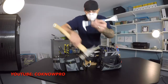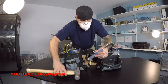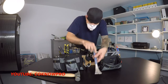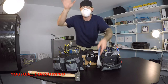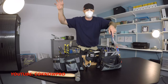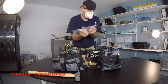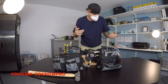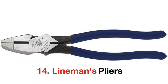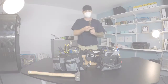This is a little cat's paw — basically a small pry bar and nail puller. You can get underneath the nail head, use it as a pry bar to pry stuff up, or when you're hanging a door, put it underneath the door, push up to raise it, and lock your hinges in. Killer tool — love that.